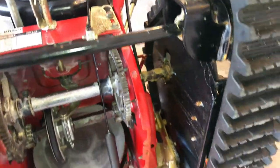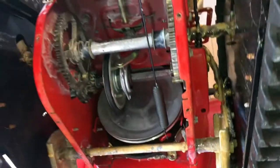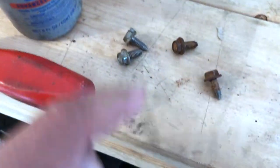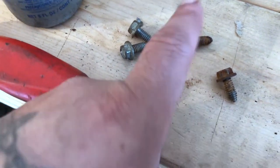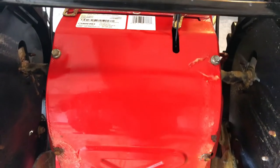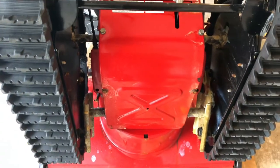Put your plate back in — I cleaned it and also applied a film of fluid film because it was starting to rust out. Mount the plate back on and to put the four bolts back in, take your anti-seize and put it on all the bolt threads before tightening. You don't want these bolts to break in there and cause headaches. If you do this every year at the end of every season, you've got nothing to worry about in the future. There you have the plate on with four bolts — fluid-film the whole bottom, then put it back up on its tracks.